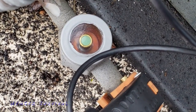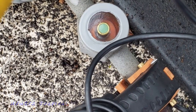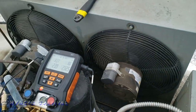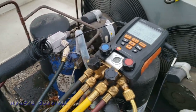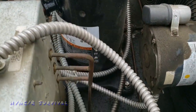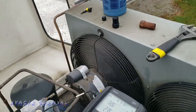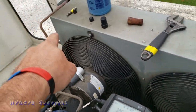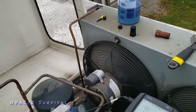We're going to try to keep a solid column of liquid to the TXV - if you don't have a solid column, it's not going to work properly. This one has fan cycle control but does not have a headmaster, so it has to cycle the fan on and off. They've got it set up so the first fan shuts down, and with three other pressure switches inside they're likely to shut down the other fan too. Generally you shut down the fan furthest away from your header.